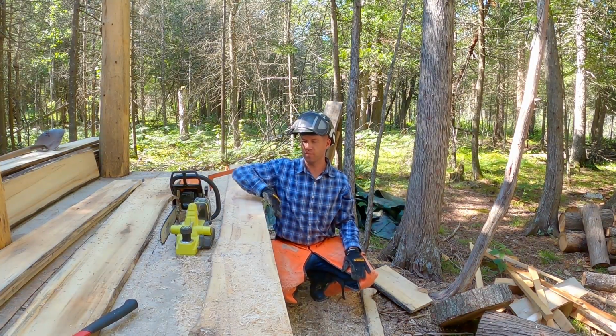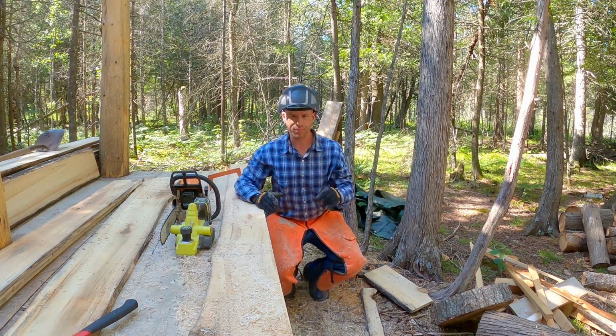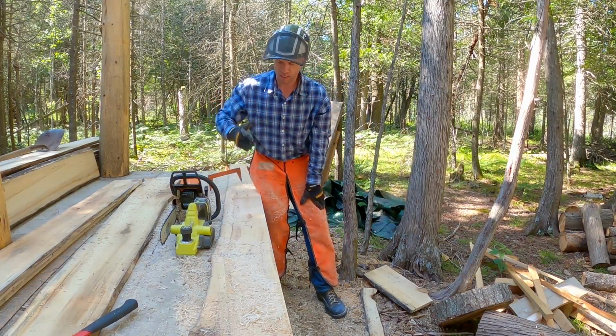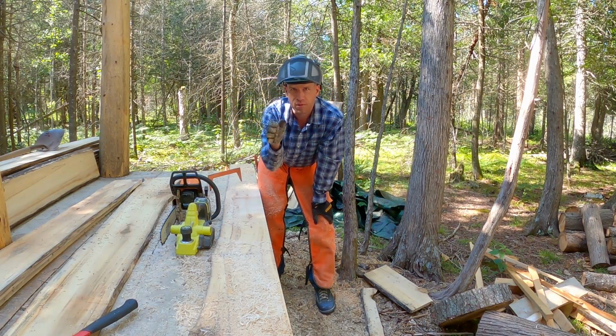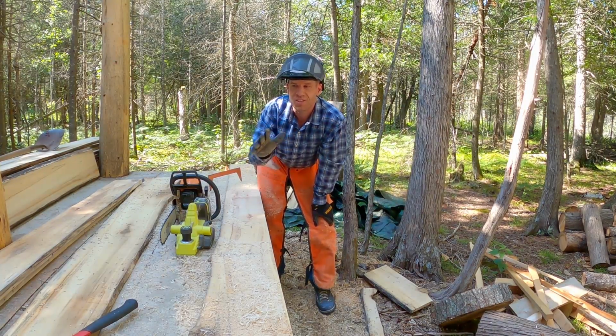The only reason I run the planer over the edges of these is when you're ripping the edge off with a chainsaw, you push the bar through, stop, push the bar through, stop, work your way through the board, and sometimes where you stopped and restarted, you'll end up with a little uneven edge on it, and it sucks when you get these just how you want it.